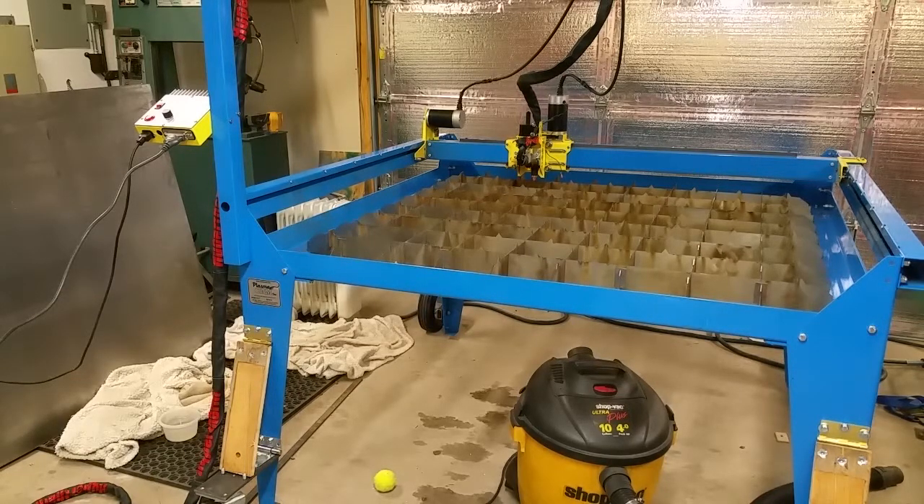There are a lot of rapids in between as well, but the key to getting good cut quality is you have to run the right speed. If you're running too slow, you can get dross. If you're running too fast, you can get dross. The idea is you run the manufacturer's parameters — cut height, cut speed, amperage — and you should get appropriate quality cuts.